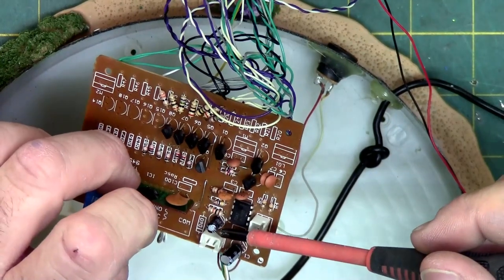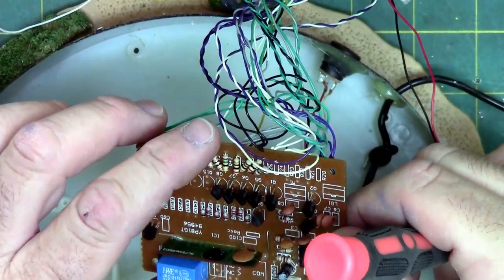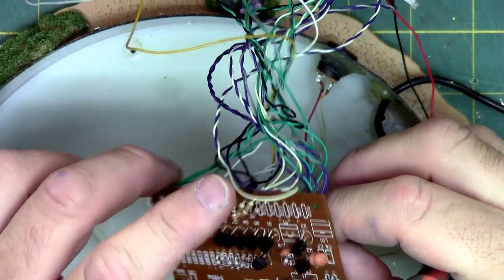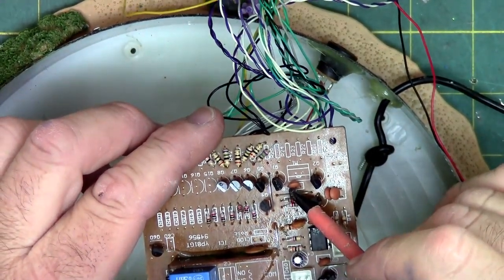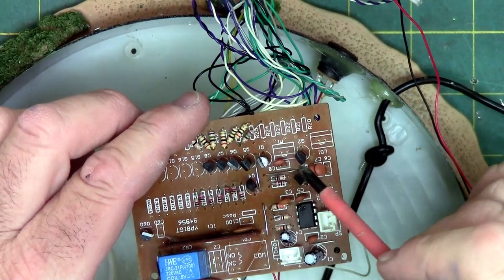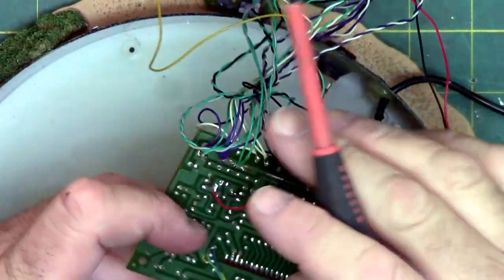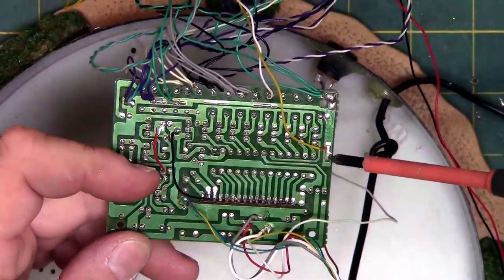There is just the smoothing capacitor — they're using that tall thin one as their smoothing capacitor. A smoothing capacitor on motors prevents back-feeding motor noise into the circuit; without it your circuit gets really noisy, things malfunction and you can burn stuff out. The other motor also has a smoothing capacitor, which is much smaller because it's in the circuit. The one on the direct-drive spinning motor is slightly bigger because it's before the circuit and can send more noise into it. I'm also zooming in so I can get a circuit board picture for reference, in case you want to take yours apart and try to repair it.